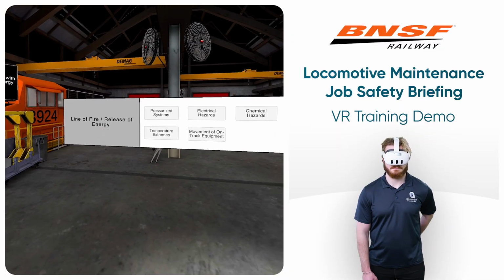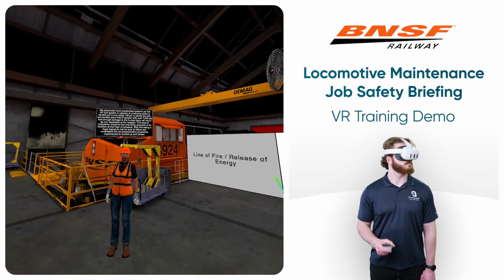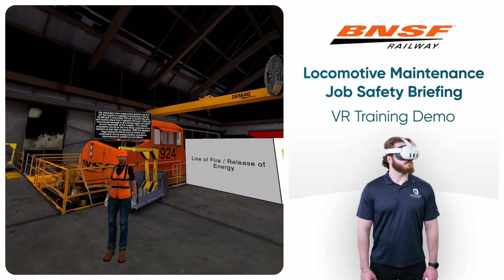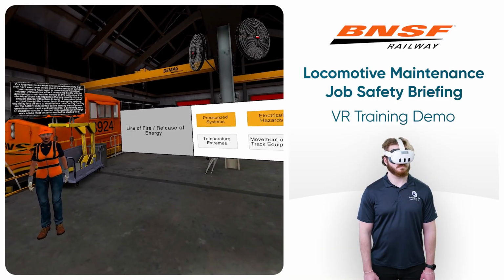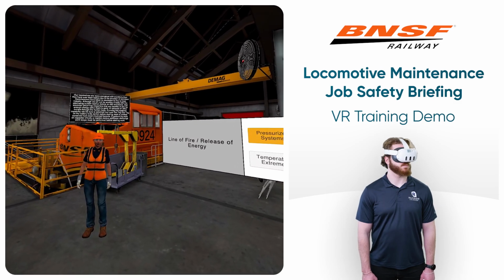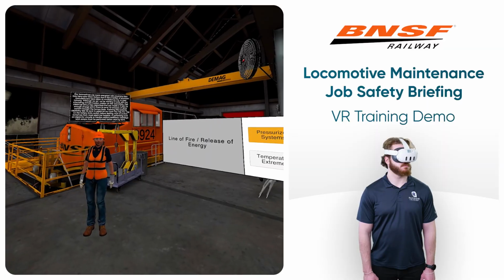Start with the line of fire and release of energy associated risks. We absolutely have pressurized systems, as this HP fuel system is capable of producing close to 33,000 psi. Our locomotives are more energized with electricity than they have ever been before. Knowing this system's capability, let's be sure to establish our lockout-tagout tag on the battery knife switch before starting work.